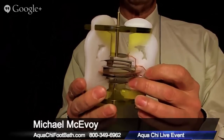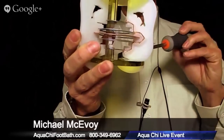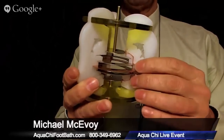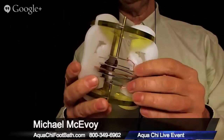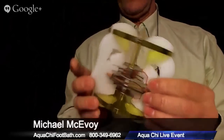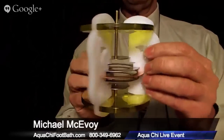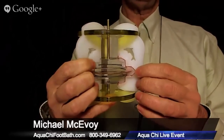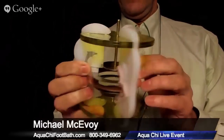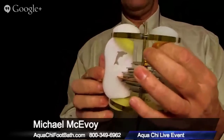What we're going to do next is change the post set. The post set is this top piece and the bottom piece — they have posts sticking up and down and come as a set, two pieces. This involves the most work; you have to be thinking about it because they're not the easiest things to get out. We'll start by finding the leg that has the shortest slits — that's this one — but be careful because the other leg, this copper one with a copper strip, also has short slits. Do not touch that leg with the copper strip at all if possible. We're not going to take out the one with the longer slits; we're going to concentrate on the one with shorter slits.